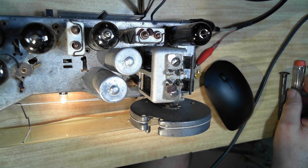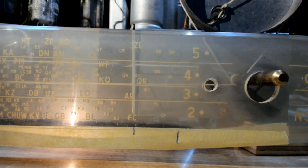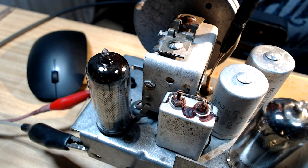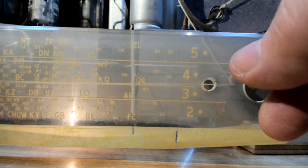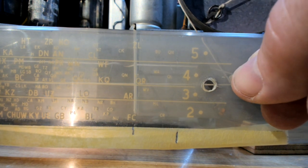All right, good enough. I just have to go back and check the 600 again there. As you expect, the 600 has changed. So this should be the oscillator coil, and I'll just trim that back, and hopefully we can pull it back. It's not far out.